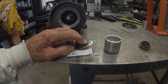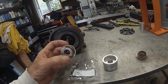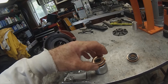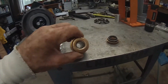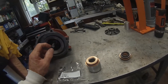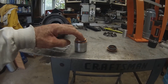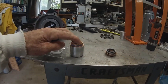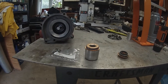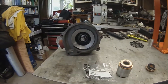So what you need to do is push this whole piece on together at one time, so you're not compressing just the one part. Because there's a lip inside this thing that gives it resistance and makes it sit tight on this shaft. So I fabricated this piece that is just a little bit broad, so if I push down I'm pushing on both the pieces at the same time. I'm going to put a little bit of grease on this just to help it slide on easier.